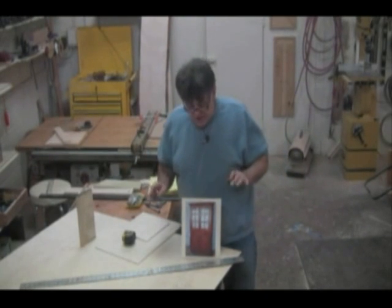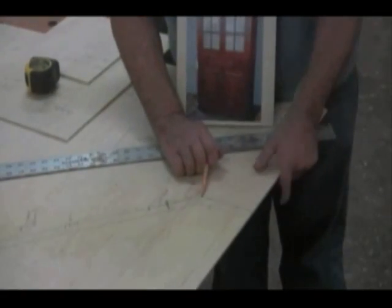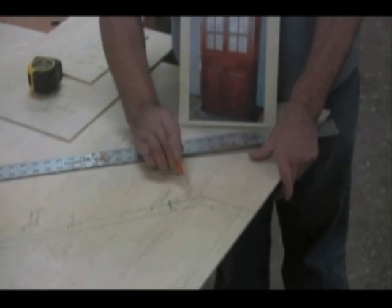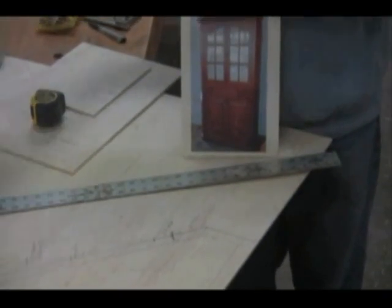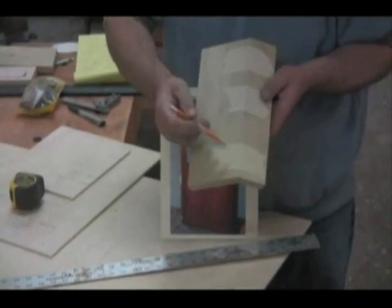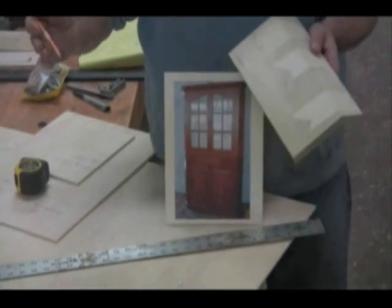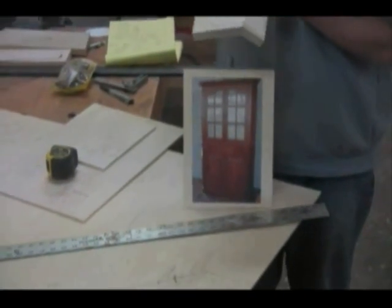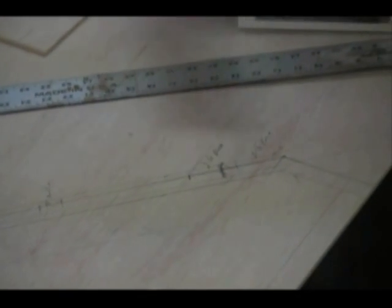So what I did was I changed this point from here to here to 4.5 inches. Then I changed the face frame side. I changed this to 4.5, this to 2.25. And the side of the door will be 2.25. So as I walk over, I've got 2.25, which is the face frame. I've got 2.25, which is the door.